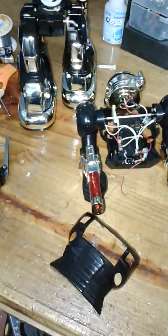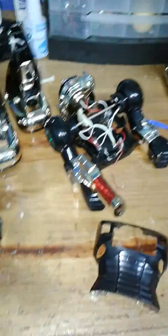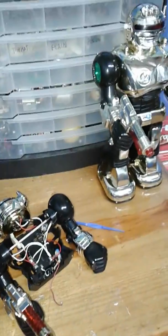The only thing I've got to do now is fix it mechanically — the 8th gear is split and the 10th gear as well, so I'll have to replace those two and then continue on with the final assembly. I hope you guys enjoyed this video. Thank you for watching and I'll see you all in the next repair or whatever comes next video.